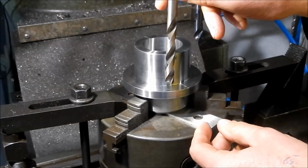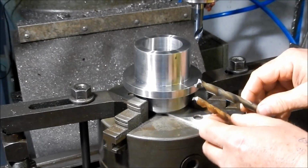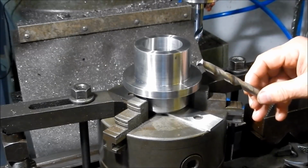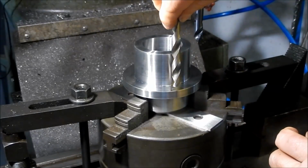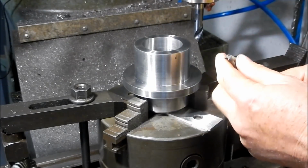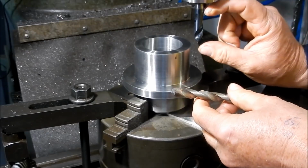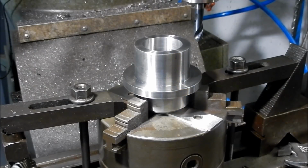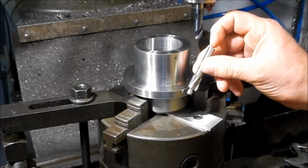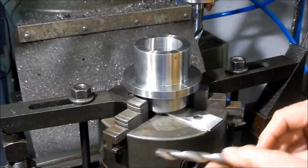Sometimes if it's a really long stretch to get down, I've just got a series of flat bottom drills that I grind up. I've got a set of these that I grind up. So the idea being that you go in with a 10 mil diameter standard drill, and then come in with this afterwards just to clean up the bore, and these do a really nice job, particularly if you've got a fair bit of depth that you need to work to and you can't get standard counterbore tools into place because they're too short and stumpy. So these are great for reaching down a little bit further.